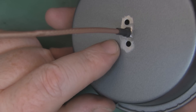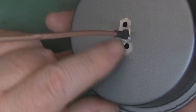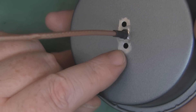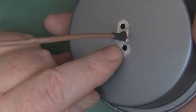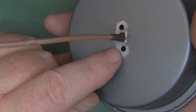That's the back finished. I also used the Dremel to grind flat the area around the holes to remove any excessive solder. The reason for this is that I'm going to be attaching nylon spacers onto the back with little nylon nuts, and I wanted a nice flat surface so everything lays flush.